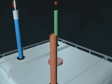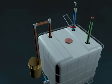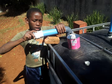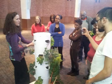For the fertilizer outlet pipe, cut off about 5 centimeters at the top and attach a 2-inch T, a piece of 2-inch pipe, a 2-inch elbow, and a drain pipe leading to the fertilizer bucket. Every time you add ground-up food waste and water from the feeding end, an equivalent amount of bioslurry is forced out because the 90-degree part of the T is lower than the feeding pipe — whenever it's filled, the fertilizer pipe will overspill and drain into the bucket. The open sky-facing part of the T ensures there's no vapor lock; otherwise you'll get a siphoning effect, as we experienced in Swaziland when we used an elbow instead of a T. The fertilizer that results is perfect for hydroponic and aeroponic gardens, diluted with gray water 10 to 1. You should never have to buy fertilizer again.